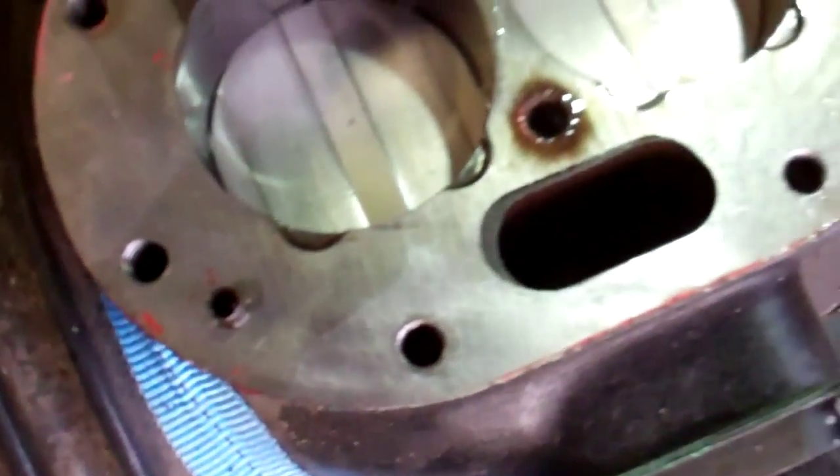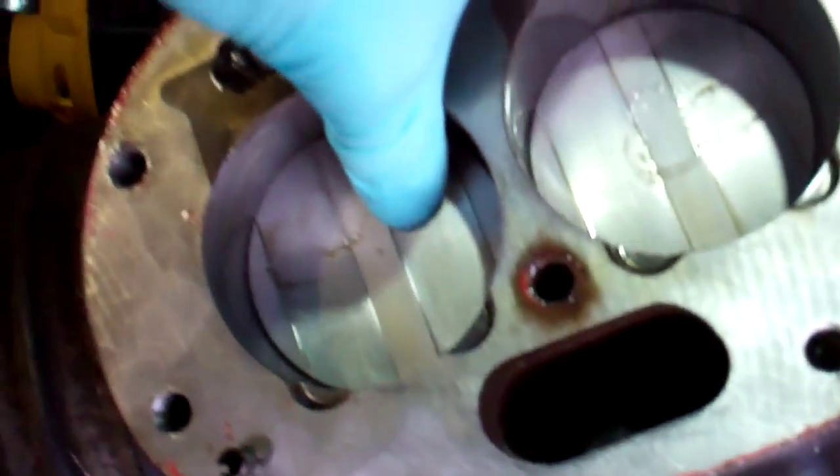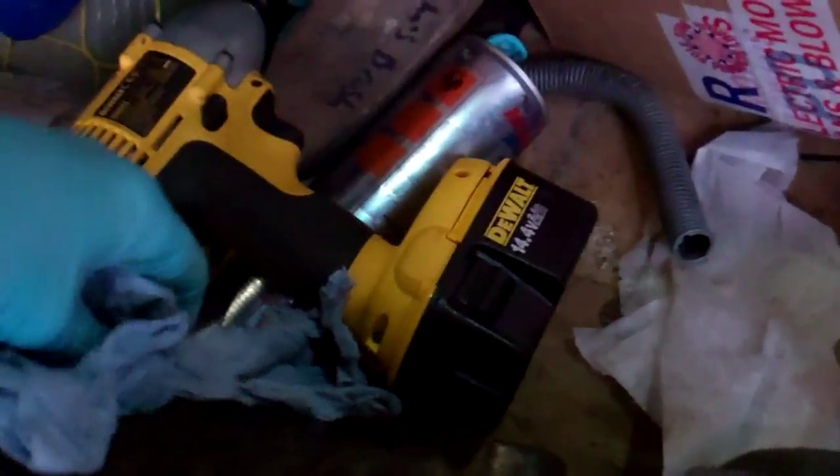The valves don't seem worn at all. You can get a ridge on them. It's not seized. It's got a big bore. I think it's probably the biggest one they do in that block — six and a half horsepower. For a block they started out as a two horsepower.